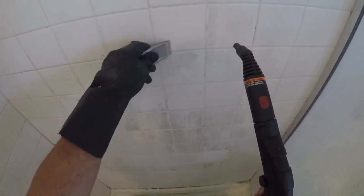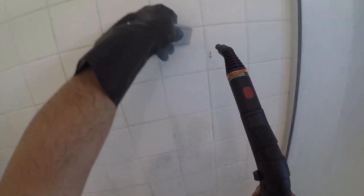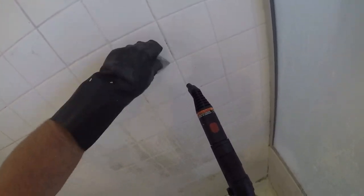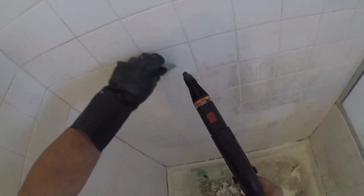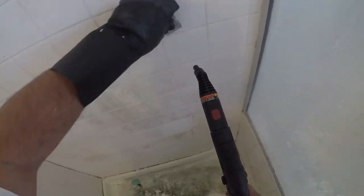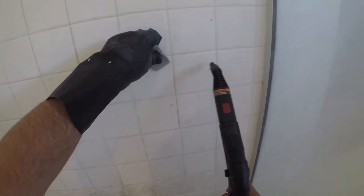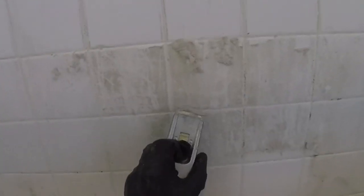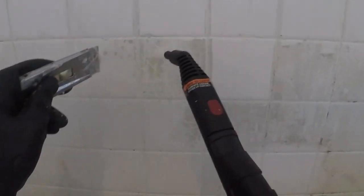This was my first time using it, and as you can see there's a ton of soap scum on this shower tile. What the steamer does is basically soften up the soap scum so I can scrape it off. I tried using the steamer by itself and coming back later to scrape, but it had literally cooled down and almost dried up again, so I'm using it simultaneously. I have to scrape all of the soap scum off and rinse it before I can do any type of acid washing, because otherwise the soap scum literally hinders anything from touching or etching that original tile.